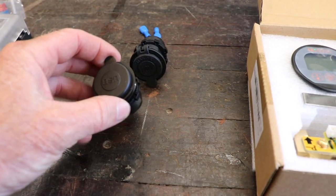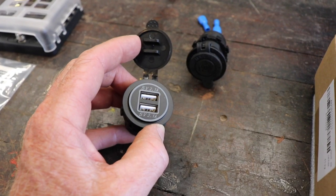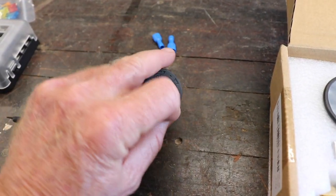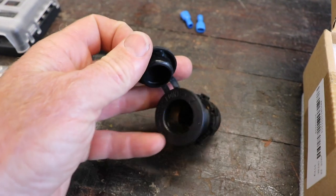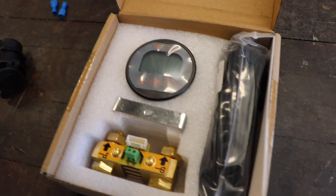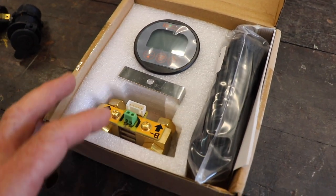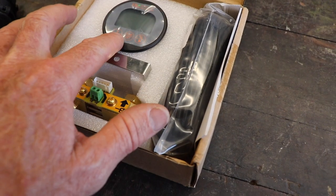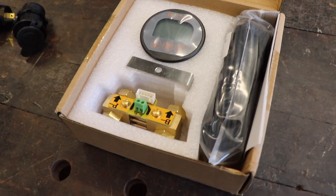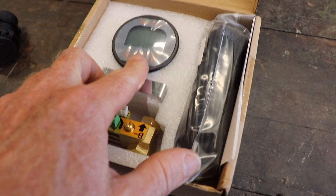I have a couple of outlets here — one for USB, with two USB ports and a little plastic cover. And this one is just a cigarette lighter socket outlet so you can plug in devices with that style of connector. Here we have the battery monitor — a cheapy, I paid about $80 for it. It comes with a shunt, and you need a shunt with these. The shunt tells you how many amps you are using. With lithium, the chemistry is a bit different from a traditional battery, and you need to manage it through its capacity of used amps.